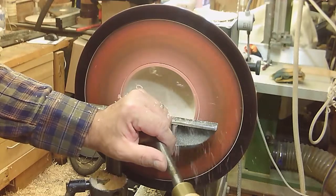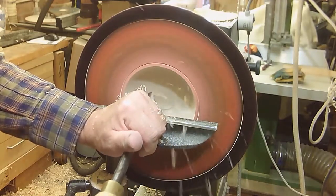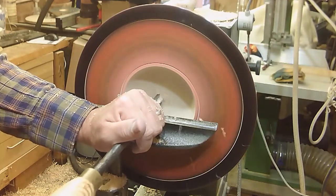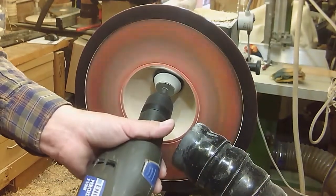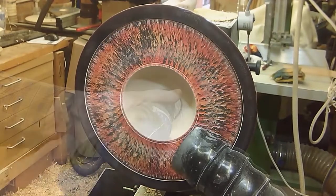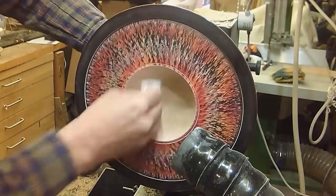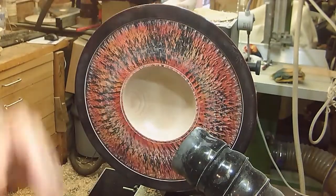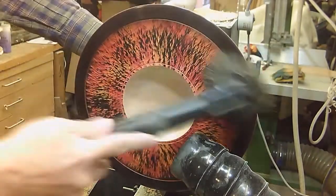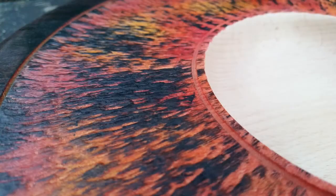The middle is just sealed with a bit of sanding sealer, just to help make a neat final cut. I'm going in there with my 3/8 bowl gouge, then sanding — not showing you all the grits, there are four or five grits I use. I don't get a perfect finish on the first grit as the video might suggest. And then a bit of sanding sealer to finish off, again cleaning all the dust off, and it does get sealed with some acrylic lacquer.